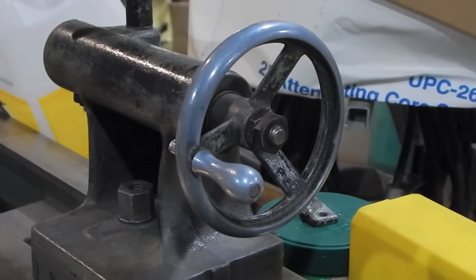I could even get a piece thicker than this and have the groove deep enough so that this thing just covers the whole thing — I might have to mill some slots. This might be stainless; if it is I don't really want to use it because it's a pain to machine. I went through my pile of stuff and found this piece right here, which I like better because its OD is not as large so I don't have to turn anything off the outside — it's almost perfect for this.